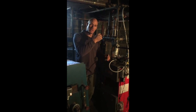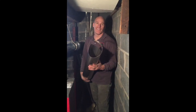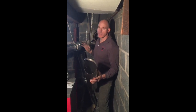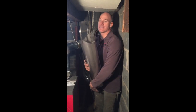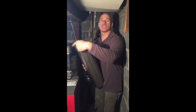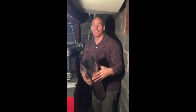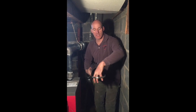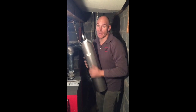Now we're going to take a look at the thimble and show you where it is. Here we go — we're at the thimble, this is where the piping goes into the chimney. You'll notice this is a stainless steel pipe and it has a clamp that wraps around it. What we're going to do is slide this in, and the liner is literally going to go down inside of here where the T is. We're going to turn it the right direction so it faces this way. I'm going to put it into the thimble right now.